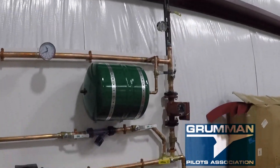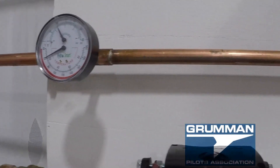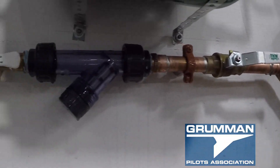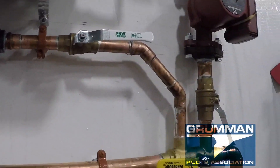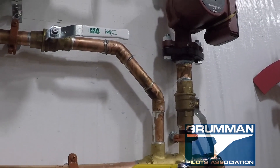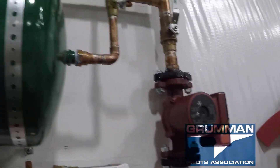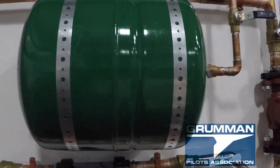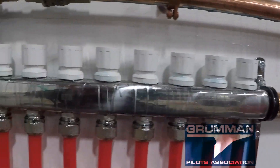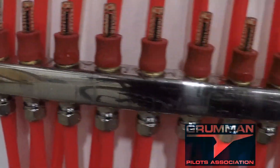We have both input and output pressure and temperature so we can see what's coming into the system and what's coming out as we heat the floor. Here's one of the small pressure gauges sitting right in the 1-inch copper pipe. We have isolator valves around the Y-strainer and around both of the motors, so if anything ever needs to be changed out, it's not an issue. There's the pump for the primary loop going into a mixing valve, our air expansion tank, isolation valve, and the manifold for the radiant ramp.